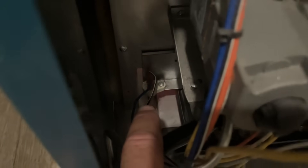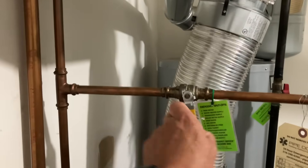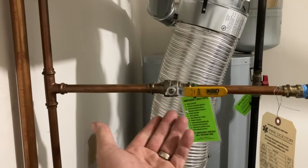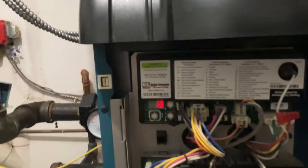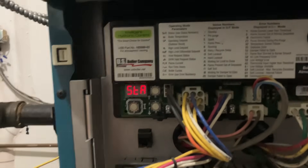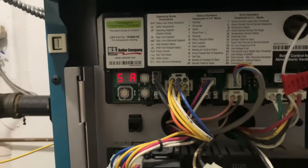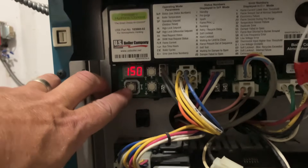The two black wires — that's the rollout switch. And right here is our resettable blocked vent switch, or spill switch. Boiler feed valve. Coincidentally, I turned off the boiler as soon as I did that, but let's take a peek. STA10 is retry-recycle delay — interesting. STA7 is flame proving. STA8 is running. Let's see why it did that. Boiler temperature 150.